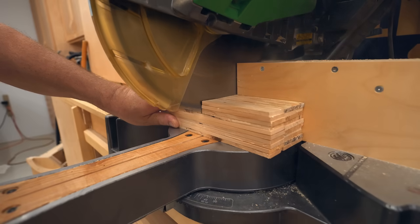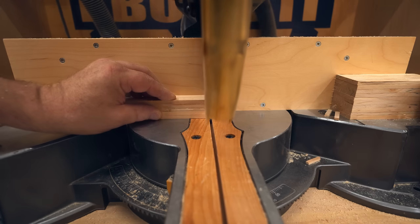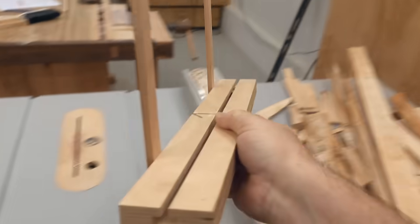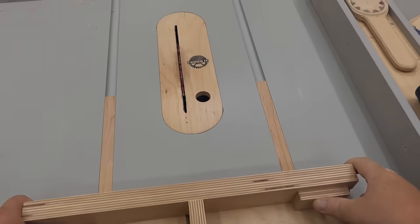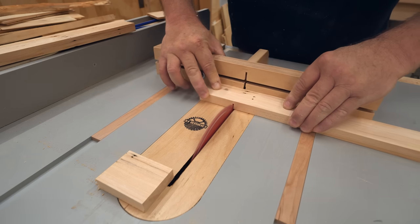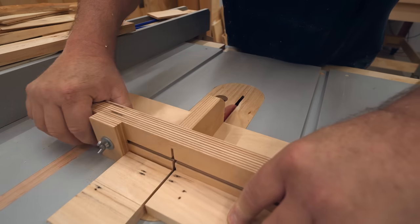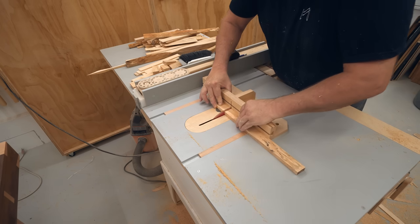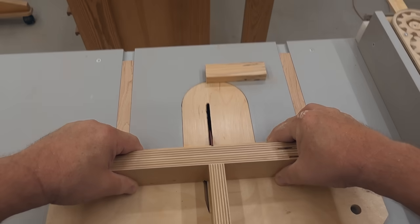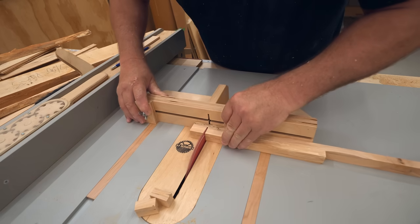Like I said, I'm doing this on my table saw and my miter saw. When it comes to cutting smaller pieces to length at 90 degrees, I always reach for my mini table saw sled — this is mostly about the quality of the cut. Too often when you're cutting small pieces the blade catches them on the way out because you're in too much of a hurry to let it stop, and it throws them halfway across the room after cutting a big gouge into them. That doesn't happen with the sled on the table saw — I push the stock all the way through and leave it on the other side of the blade.